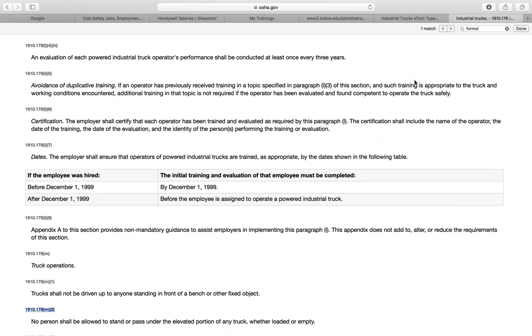And then workers must also stay clear of any type of fall zone. The area's diameter is twice the height, kind of like we talked about before. So if the height of the load is 8 feet, we're probably going to want to stay 16 feet away from that load. So that's a lot of space, folks. So let's use something relative. Let's say the load is 6 feet. Well, we're going to keep employees at least 12 feet away from that load.